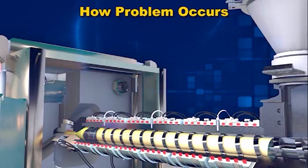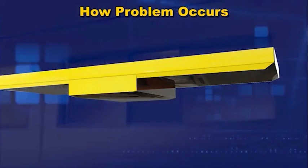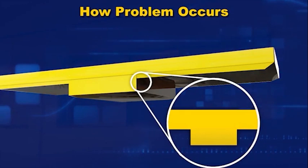When plastic is heated and melted in the barrel, it expands. Then the heated plastic fills and packs the cavity. Here is the part we just molded. Now we'll cut away the part and show what happens to the plastic inside.